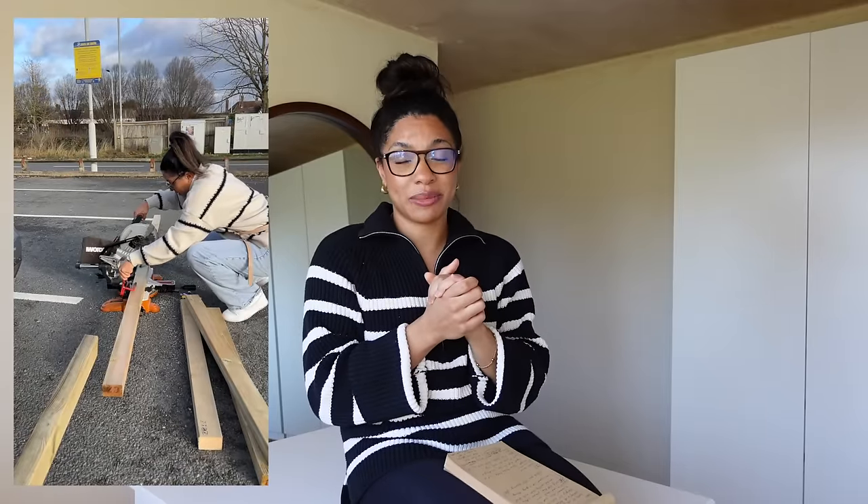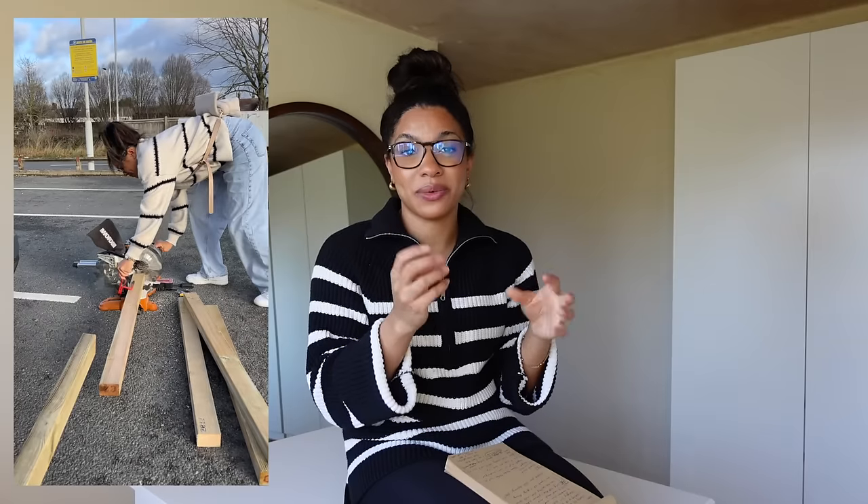I know people give IKEA a lot of slack for quality, but I feel like if you treat them well they can last. For the build, we went with a timber base instead of just using the floor, because we wanted to add skirting along the bottom to give it that built-in look. We bought 70mm thick timber from B&Q. We brought our mitre saw to the B&Q car park - thank god it's cordless - cut all the wood to size, brought it home, and installed it. You don't have to use a base, but make sure your floor is level. We're also adding four centimeter strips of wood between each wardrobe rather than placing them directly next to each other, and we'll front that out with some MDF at the end.